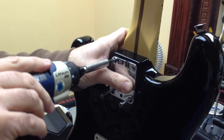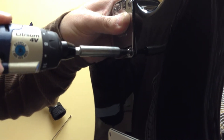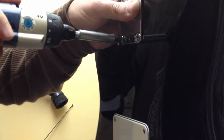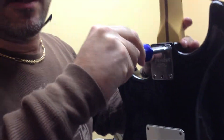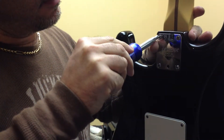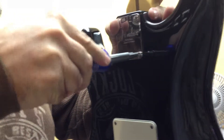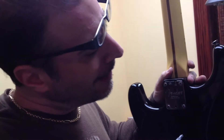Very loose. Then go to this one, very loose, then this one, then this one. Now get a regular screwdriver — very low torque setting. Just a little nudge; I felt it touch. Now a little half turn like that. Make each screw touch the plate, then just a little snug — that's it. Don't over-tighten or you'll strip the wood.